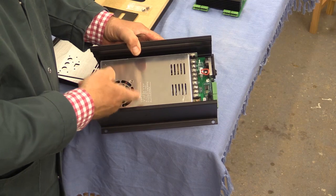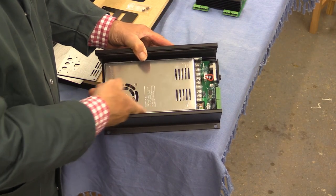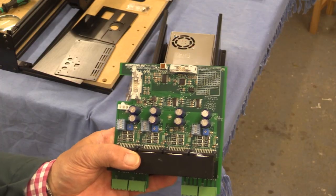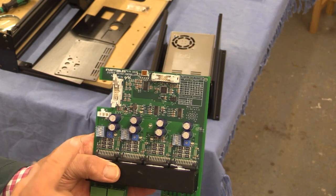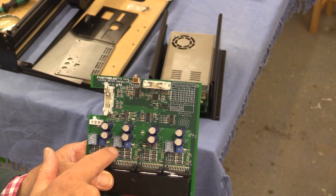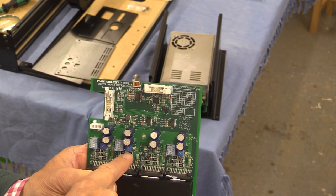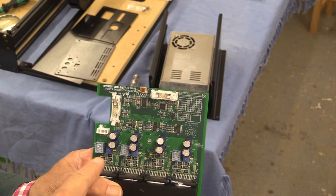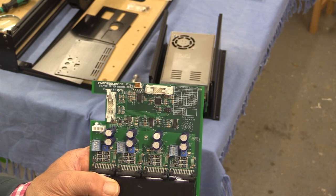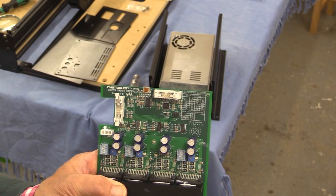Do note that if you've forgotten to check that power supply, whether it's 115 or 230, then it's too late to do anything about it now. You now need to check the controller board. There are some little DIP switches here, here, and here, and some little micro potentiometers here, here, and here. You need to make sure those are all in the correct position. There is a diagram — it's easy to follow. I've checked mine and mine arrived correctly set up.